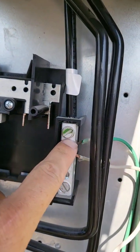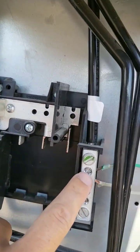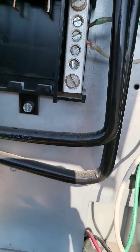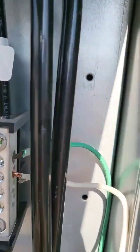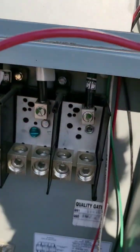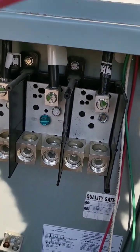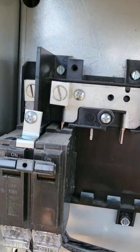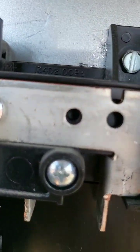So does this need to be bonded? Because this is the first means to disconnect. Technically, we're bonded down here, so we've got a path from the case back to the neutral — that's our ground wire there. So technically, this system is grounded and bonded there. But also technically, there probably needs to be a ground screw in here.